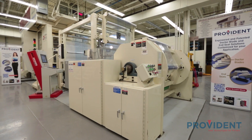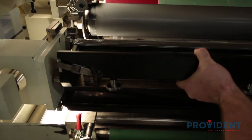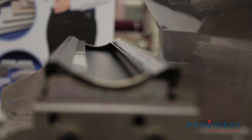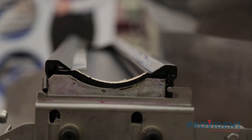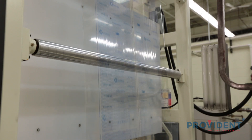I'm standing here in front of the PCMC Avanti Flexa Press. This is an eight color CI that prints a maximum web width of about 50 inches. It uses enclosed chamber systems. The enclosed chamber system uses two blades, one wiping and one containment with two end seals. This style of system prevents dust, dirt, and other particles from getting into your ink and also avoids solvent flash off to help keep our inks a lot more consistent.